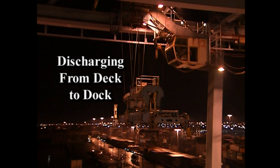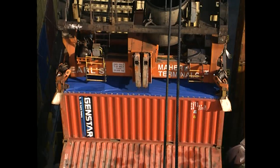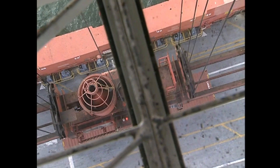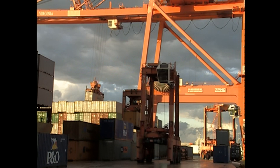When you gantry and trolley to the container's location, first verify that the container securing gear has been removed or unlocked before you attempt to lift it. If it is not fully disengaged when hoisted, you may damage the spreader or container. Before lifting, check that lashing gear has not been placed on top of the container, as falling objects could cause serious injury to workers below. Lower the spreader carefully onto the container — you may not have room to use all four flippers, so be precise when landing the spreader. Once aligned and twist locks engaged, lift the load high enough to clear any obstacles.